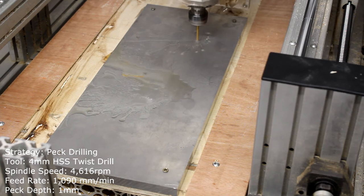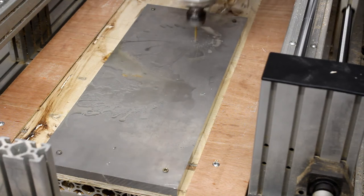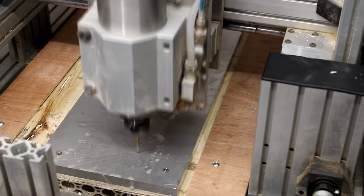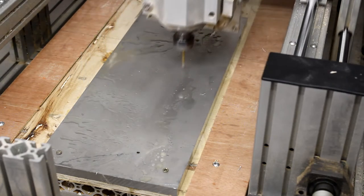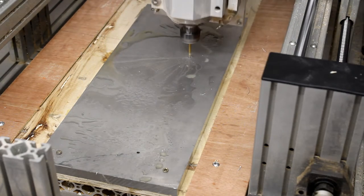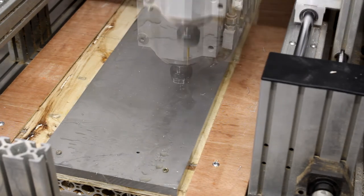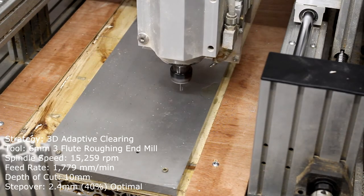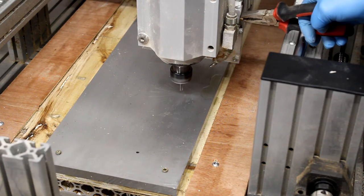With that out of the way, we then do drilling again with the same feeds and speeds. I did the feeds and speeds for aluminium so there's no need to change them for wood. We drill into the actual aluminium plate itself, plus an extra hole where I've got a set screw — a bolt that's going to attach or at least tighten the axle into the throttle arm.